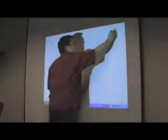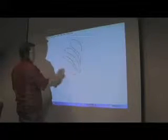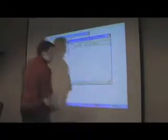lose tracking resolution. Once I connect the Wiimote to the computer over Bluetooth, I can do a standard 4-point touch calibration like they do on most electronic whiteboards. What this does is it maps the camera coordinates to the projector coordinates, and now the cursor will show up wherever my pen is, and I can simulate a mouse and draw in a drawing program or manipulate my windows.